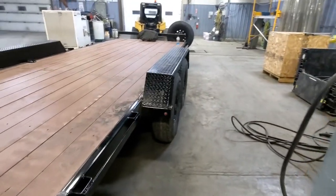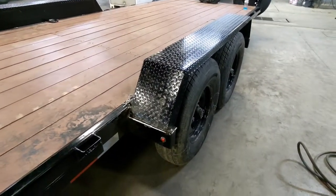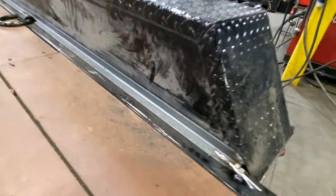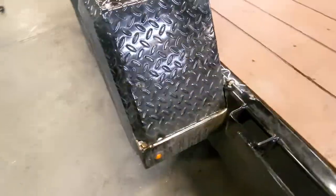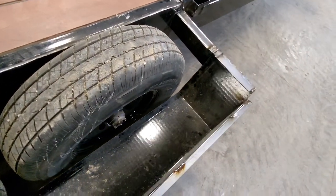Aside from the paint, one side of the flip-out fender is done. I've welded angle iron all the way along the inside — that's the hinge all the way along. These pins lock the fender in place; it's solid, it will not move, it will not lift up until you take these pins out, and then it just goes down and rests on the tires.